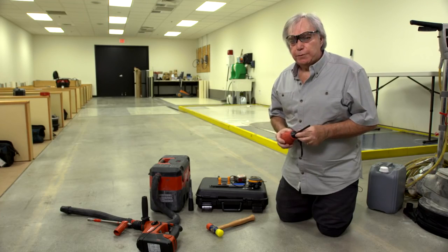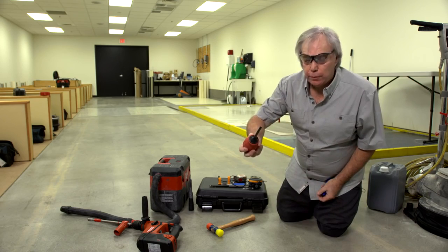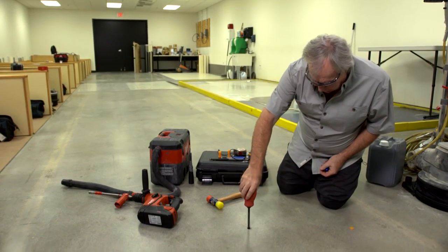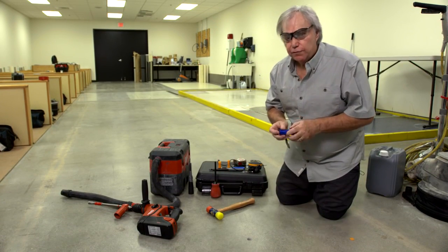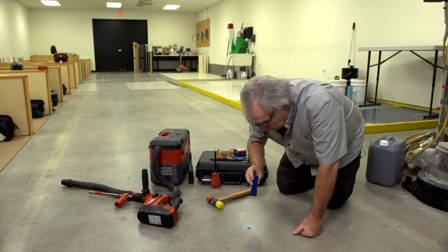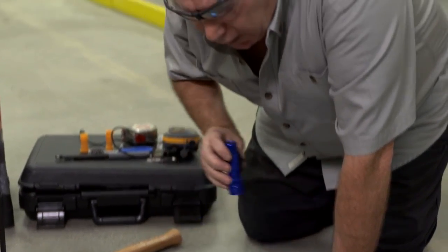The last two steps in the process verify that our cleaning process has thoroughly cleaned the hole. Here I'm using a squeeze bulb to blow air into the hole to make sure that no dust comes out. The last step is using a flashlight to look at the very bottom of the hole. You want to be sure that where the drill bit has stopped is not in the heart of a large piece of coarse aggregate. If more than half of the bottom of the hole is coarse aggregate, you're better off to drill a new hole so that you have at least 50% cement paste to ensure an accurate measurement.